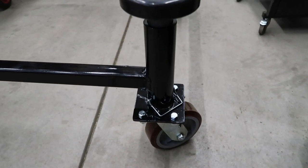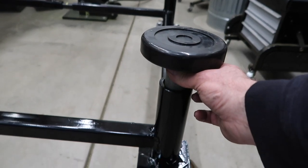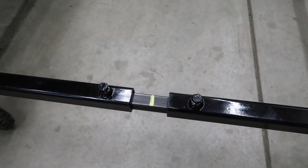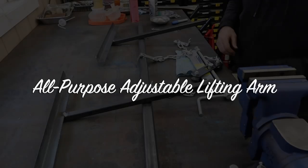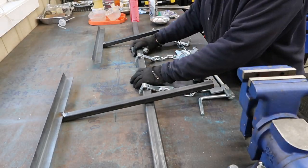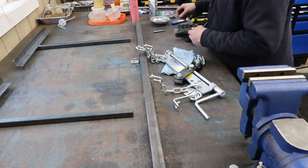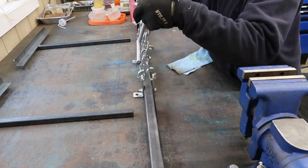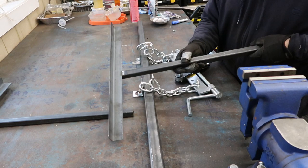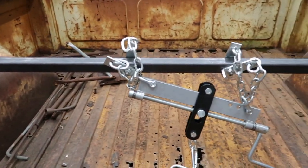Here's the finished adjustable leg assembly and here's the adjustable frame rail. We created the all-purpose adjustable lifting arm from 60 inch long, one and a half inch square tubing. This can be attached to our engine hoist load leveler to pull the bed from the truck. We attached angle iron to 24 inch long, one inch square tubing to make the adjustable arms. As you can see, it'll fit nicely under the rails of the bed.